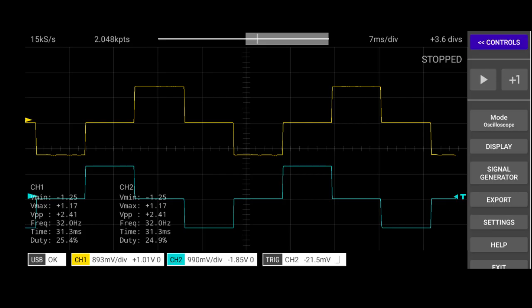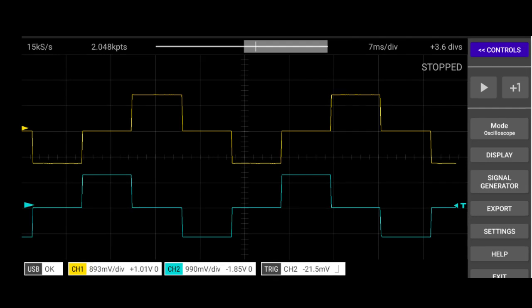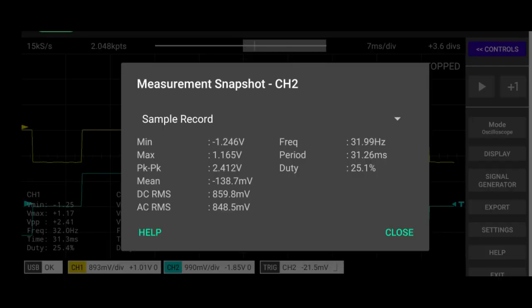What's even more interesting is the waveform of the drive signals. There is no DC bias — it is actually AC bias. It goes positive, zero, and negative as well. The phase relation between the two common signals is set such that when one signal goes high on the positive or negative side, the other collapses to ground. The frequency of the common signals is 32 Hz, which again reflects the binary nature of the system. The alarm sound in such a clock has a frequency of 4096 Hz — again a power of two.